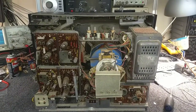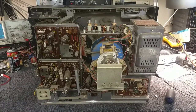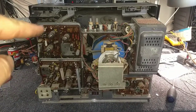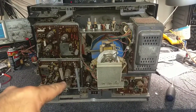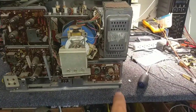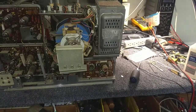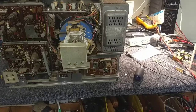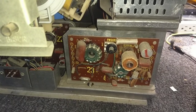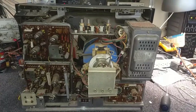That and clean all the switches and controls. We've got two chroma modules up here that we're going to start with first, then our video amp module, our sound, and our horizontal sweep — which I think will be last since we know that works. It's interesting how they have the sockets installed here to dissipate a lot of the heat that would nominally occur with other styles of sockets.